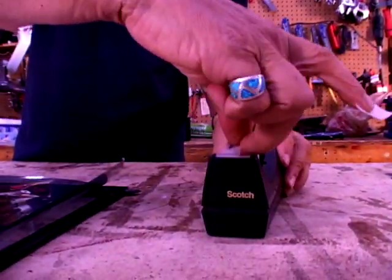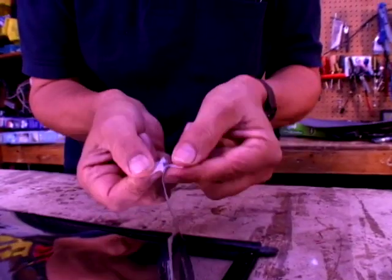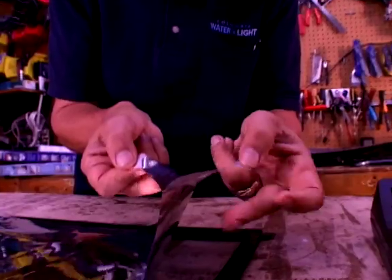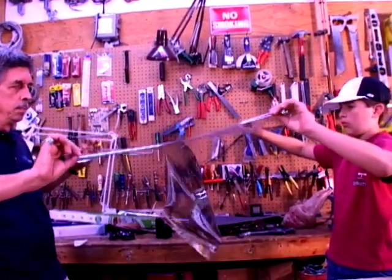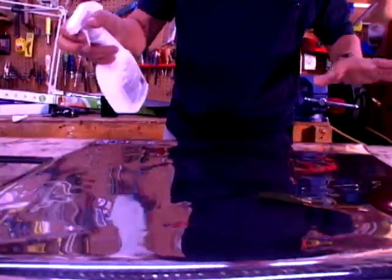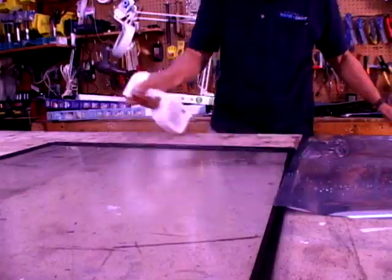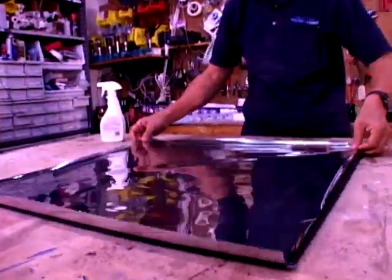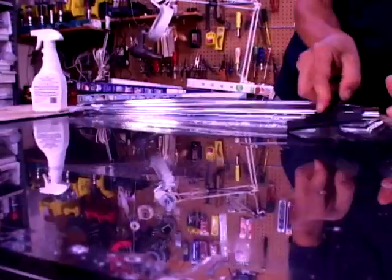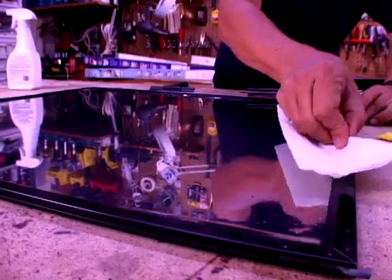There's a clear sheet and the inside of the film will have some adhesive on it, so we need to separate those two before putting it on the glass. The way you do it is use some scotch tape on the back side and the front side. This is where you need some help, because you want to get this film taken off very gradually — it helps to have another set of hands. Then we use the solution to adhere to the back side of the film where the sticky part is, and to the glass itself. We're going to apply this wet to wet, and then squeegee out all the air bubbles from the middle and take care of excess fluid.